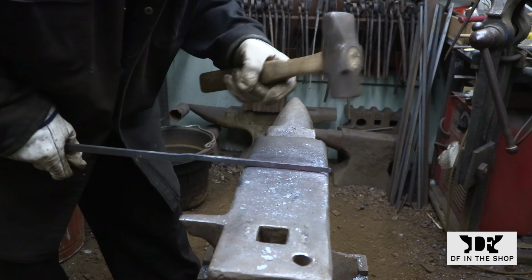I'm going to be shaping the tines by wrapping them around a scroll form. This is my number 4 scroll form, and I use it probably the most because it's that classic nautilus shell shape. If you're not familiar with my scroll system, I'll have a link to the videos in my description, as well as other related videos.